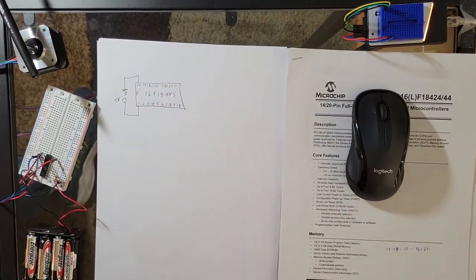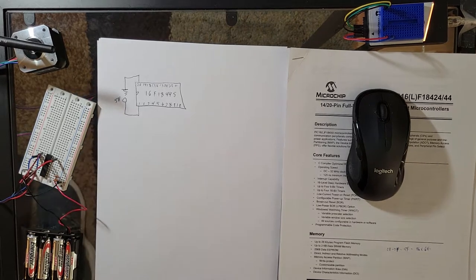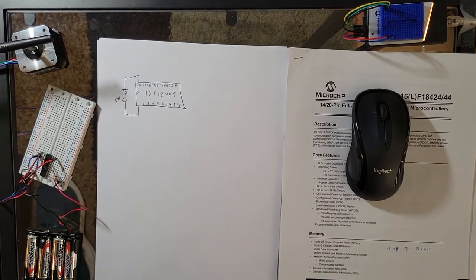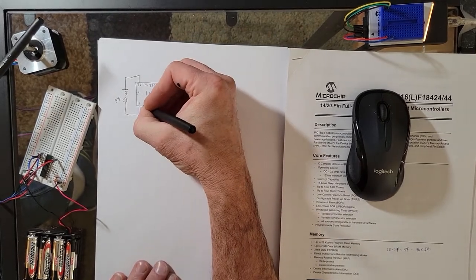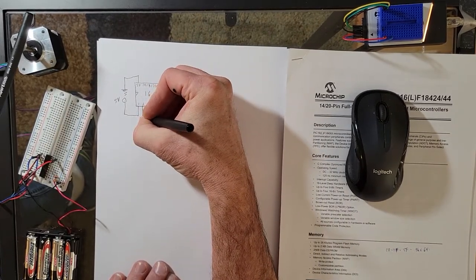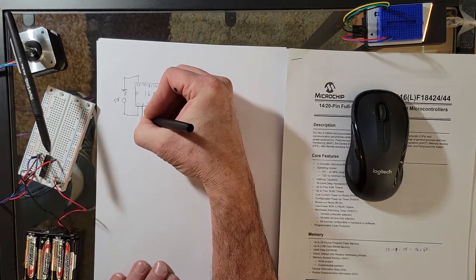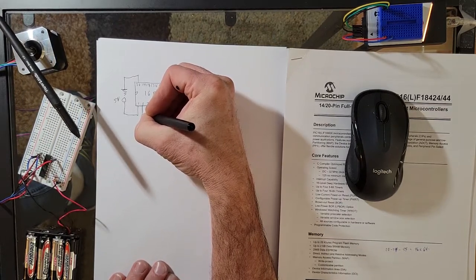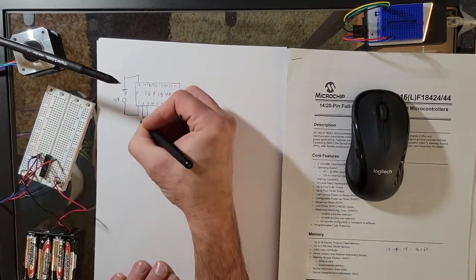Okay, so the oscillator can only go on 2 pins. It has to go on pin 2 and 3, as you can see right there. Is that right? Is that in the picture? Yeah, it is. Okay, so the oscillator has to go on pin 2 and pin 3, and it will look like this. So it'll come down, and it will have a little, what we call the drawing for a crystal.